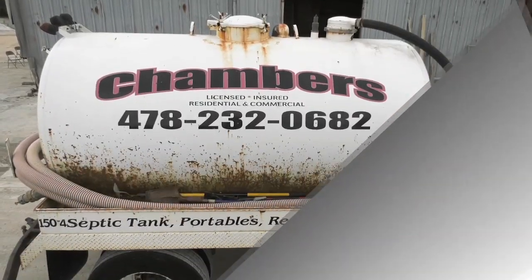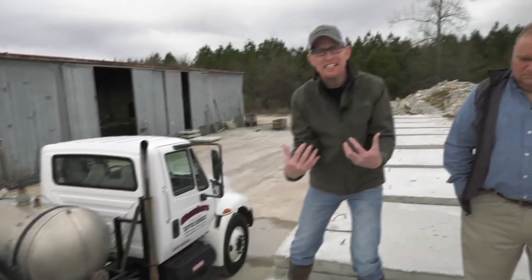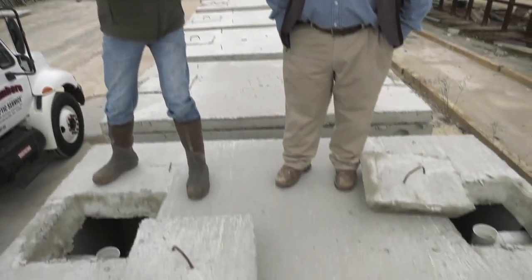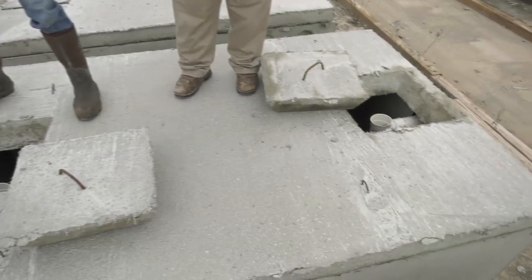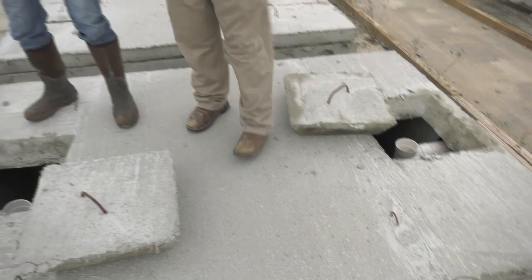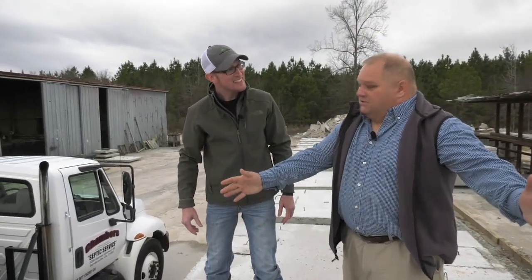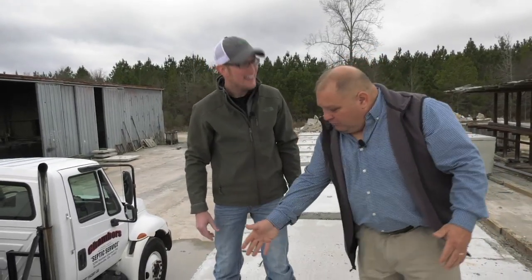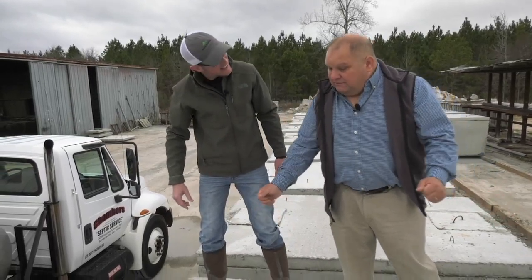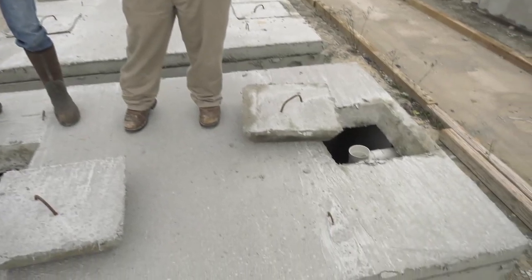So let's do that. Okay, so the septic tank, we know about how it's installed. We know about how that water is leaving the tank. We're standing on top of a tank right now next to a pumper truck. Rocky, once this thing's installed, what are some things that you can help me do as an extension agent to maintain this thing? So one of the things that I look at is educating homeowners. Not only do I want to help them with their pecan trees or their fruit trees or the garden, I want to tell them how to maintain things in their house. So having your tank pumped out every 3 to 5 years, having your filter clean. A lot of people forget that yellow thing.